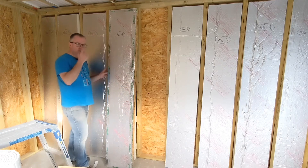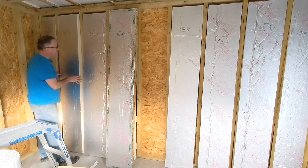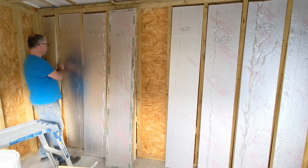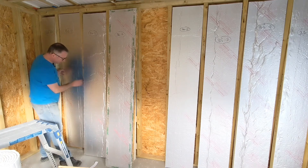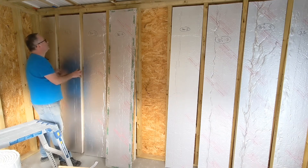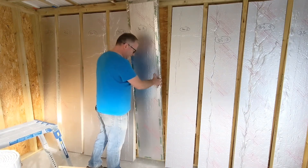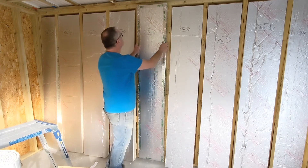This one's ready to go in. For example, I've cut this as straight as I can — that's actually pretty good — but even if I got it in that tight on both sides, I can see down there there is a gap in places. It's touching nicely here, but there's actually a two or three mil gap down the bottom. That's your performance gap. With this Gapo tape around the edge, it should just slot in.